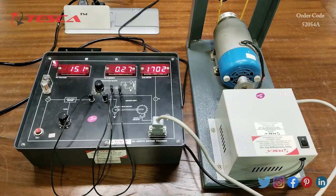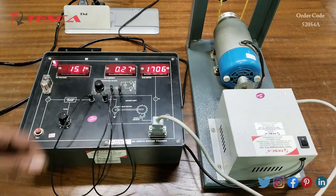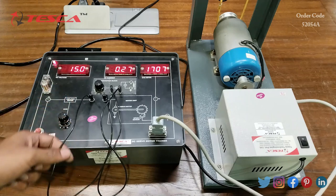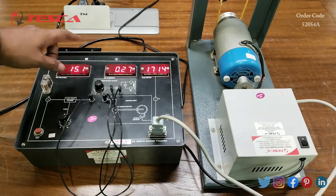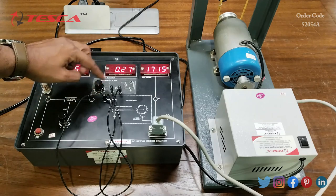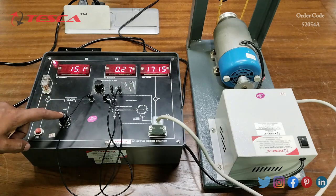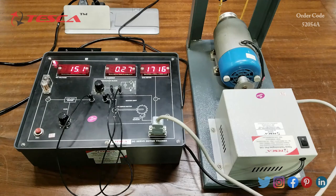Some key points to keep in mind while performing this experiment: connect the RS232 cable properly; connect test point 5 to test point 6, and test point 2 to test point 3. Before switching on the trainer kit, keep the field excitation block port P2 at the fully clockwise maximum position. Also keep port P1 at minimum (0) before switching on. After switching on, press switch 1 so the relay gets triggered.